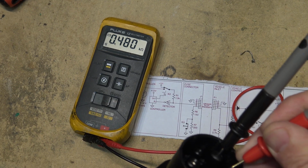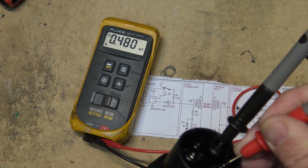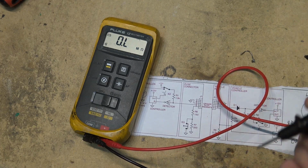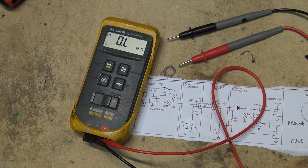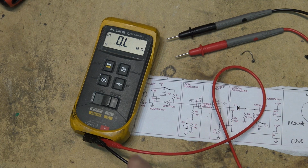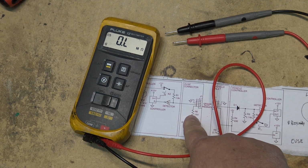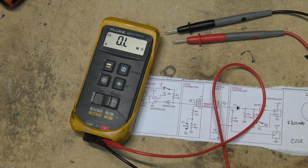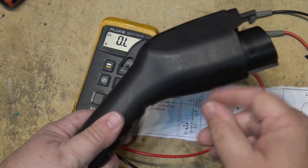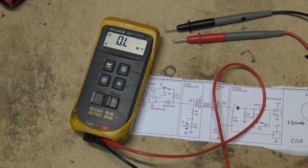which is to tell the car to stop charging, and the car then, of course, shuts down the other line. Now, the charger is defective. When I test the same thing, we'll see that the switch probably isn't working in the other one because it's not toggling, although the pilot signal is not present. But different chargers, it's an older charger, so it may actually turn the pilot off if it's not getting any proximity fed back from the car. Let's just measure it. It might even be the switch in here that's bad in the other one. Let me measure that one because I haven't tested that yet.